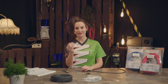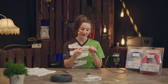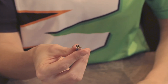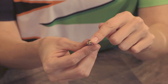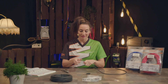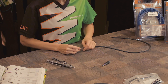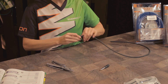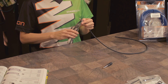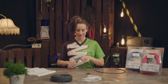Here we have the solderless jack plug. Its shell is made of glass fiber reinforced polyamide that we simply slide over the cable. Here we see a gold plated solid pin. In the center of the connector is a needle 6 millimeters long. Now we push the cable end all the way into the connector and screw it down. Using an 8 millimeter fork wrench or a pair of pliers you can fasten the pin even tighter for a still higher strain relief.